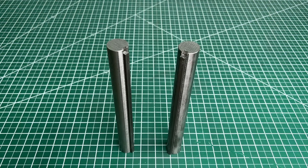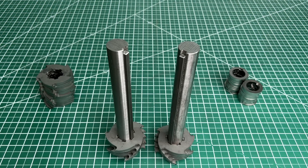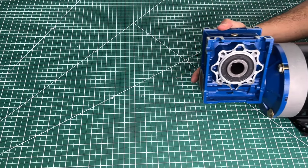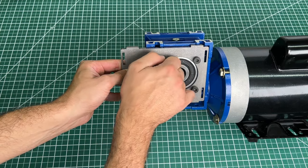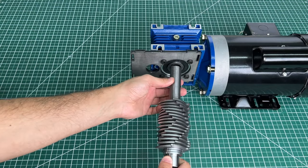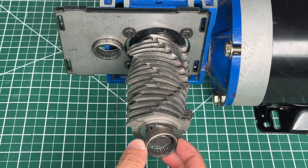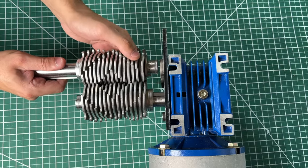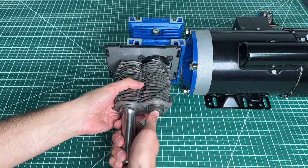The kit assembly is very simple. With all the parts laid out, we begin by inserting all the blades and spacers on the shafts in an alternating order. Once done, we set that aside and prepare the gearbox and motor assembly by mounting these plates with four screws. We then slide the assembled shaft into the gearbox, along with the two bearings to ensure smooth rotations. We slide the other assembled shaft into place — it's important that the blades are aligned perfectly, so we take a moment to ensure this was properly done.